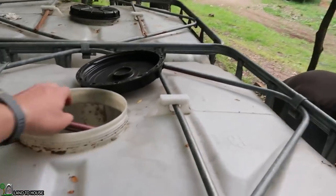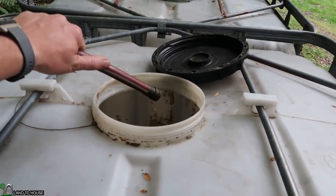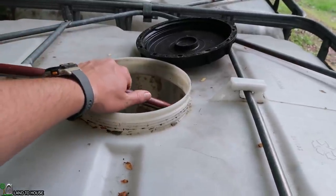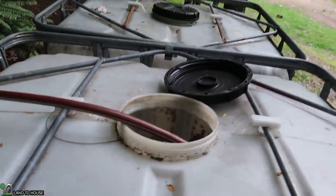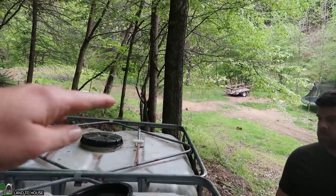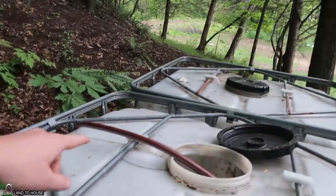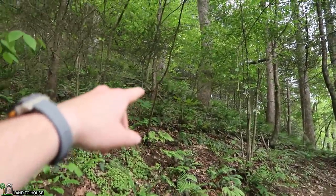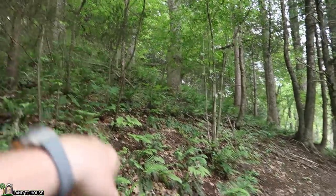This thing is surging, and that is probably due to being right at the level of losing back pressure. He can either bring the pump up in the creek a little bit to reduce the potential, or he could take the delivery pipe, run it up the hill to gain more height, and then bring it back down.